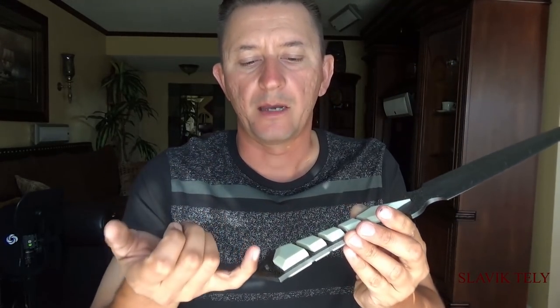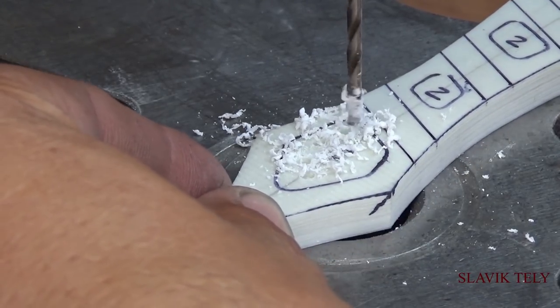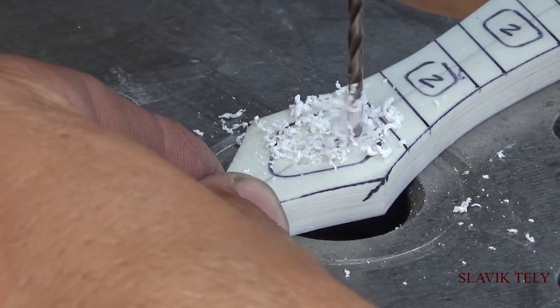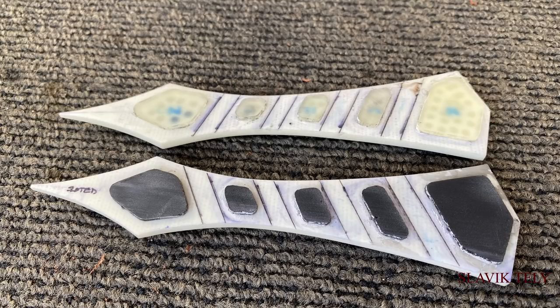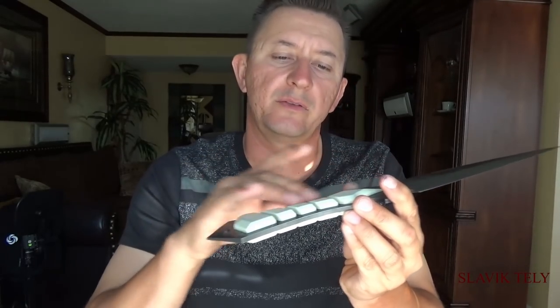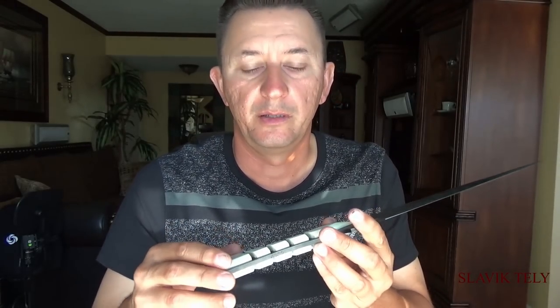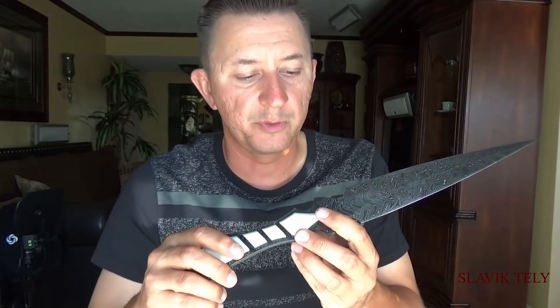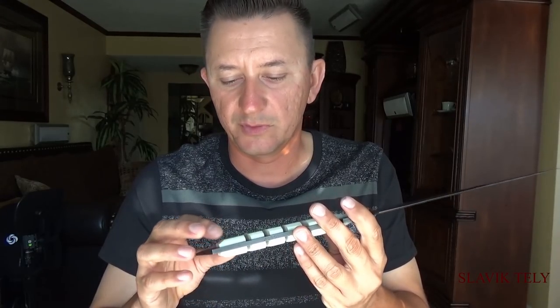After I shaped the handles, on the inside I drilled into them to provide more bonding area for the glue to grab onto. The reason I used black glue on one side and clear on the other was to distinguish the handles so I don't mix them up. Vaseline was applied to the face and inside so I could later pop the handles out and work on them. At first I thought they wouldn't come out, but eventually they did and I was so happy — it was a little nerve-wracking.